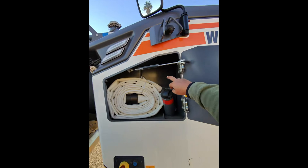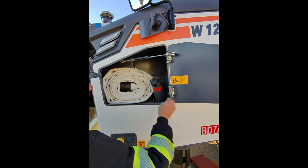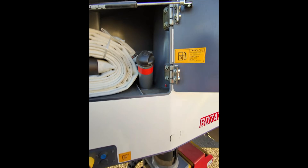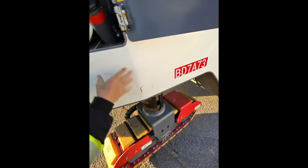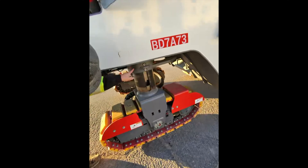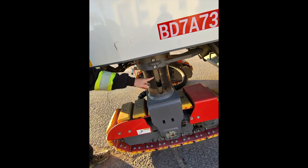This is where the fuel goes. And this is your grease point for the leg tube on the front — never been greased. So you have to remember that's there. Yeah, this is inside then, so that greases the inside of the tube. And then these — all these grease this ring and the slots for the steering.